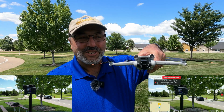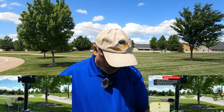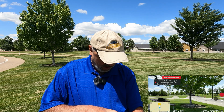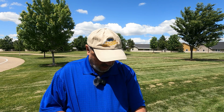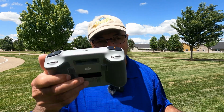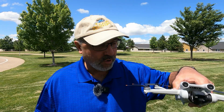Let me get everything shut down and we'll do a quick conclusion. Stop recording. Remember to do that. And I'm stopping that screen recording. Yeah, and that gave me the chime there. You want to do that, and that ensures that those video files are closed out and saved to the SD card on the controller and the video on the drone.